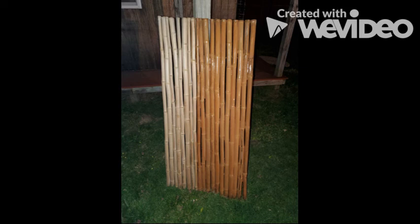But once I did that, I used the stain that I bought. You can get any deck stain. I wanted a darker stain, so I chose a semi-transparent one from the hardware store, and that's the color I was looking for. And if you do a few layers, it gets darker.